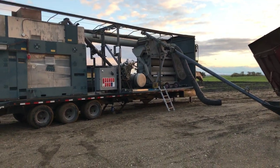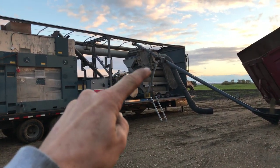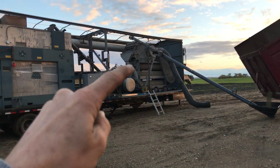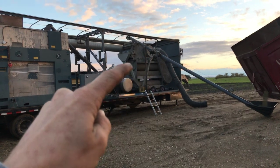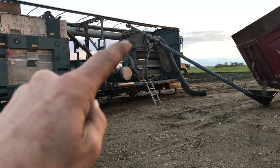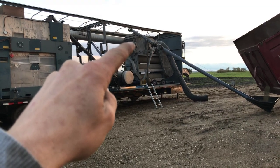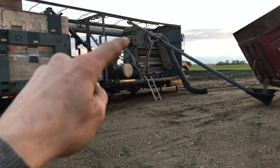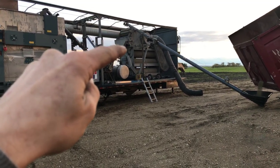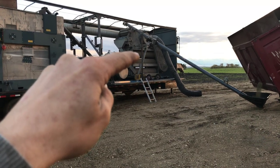Right now I'm not using it, but the primary use for it would be to take the short stuff out. You can see the roll in here — the grain goes inside the rolls and it sorts by length. There's a U-trough that goes right through the middle inside that roll, and inside the trough there's an auger. The grain goes in here and it goes over this scalper aspirator, which is just a fancy word for a mesh roll that takes off the big chunks — any stalk and that kind of stuff — and puts it in the screenings. The good grain goes through and into this roll right here.